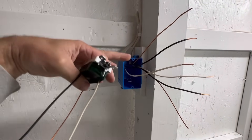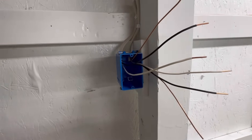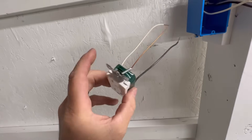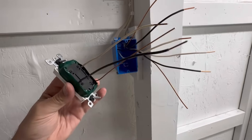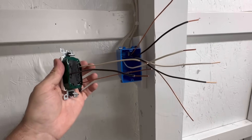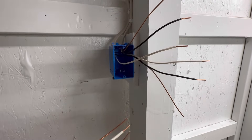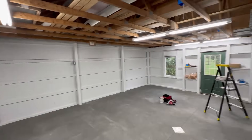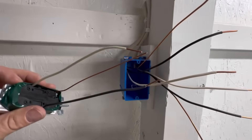Here's one of the outlets I'm wiring up — two wires coming into the box, one comes in for power supply and one goes out, daisy-chaining over to the next outlet. I've got pigtails on, and yes I do wrap those in tape so I can never accidentally grab both terminals — I've done that before years ago. I'm not an electrician; I just refuse to pay for one when I can do these things myself. This isn't a how-to video, just showing what I'm doing. Got almost all of them done; still need to get up there for the garage door opener ones.